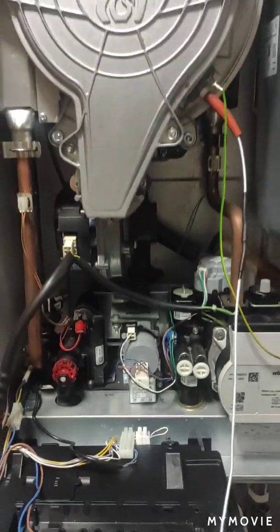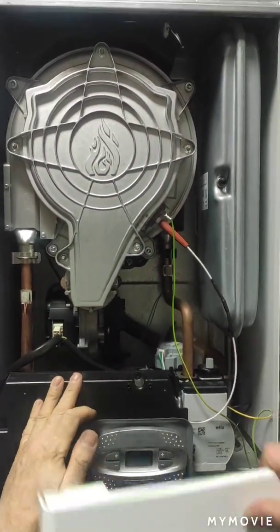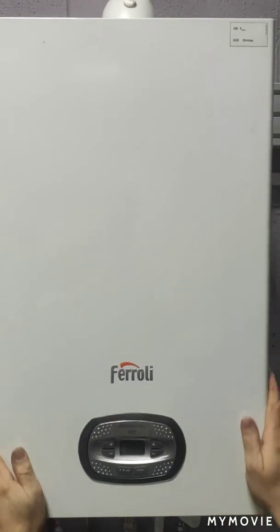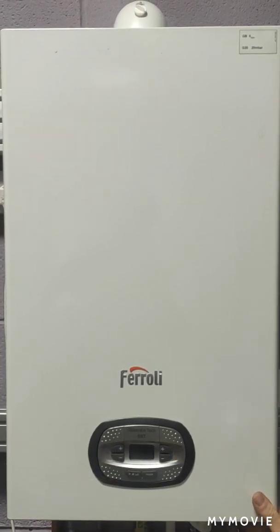It's very important when we do the next stage — you must have the front cover on. Otherwise, if you've got something wrong with the flue, it won't set up properly. It will just pick up that you've got a bad flue reading if you've got something wrong with the flue.